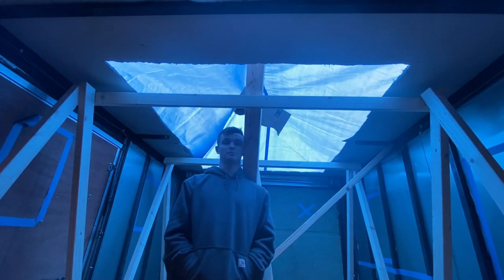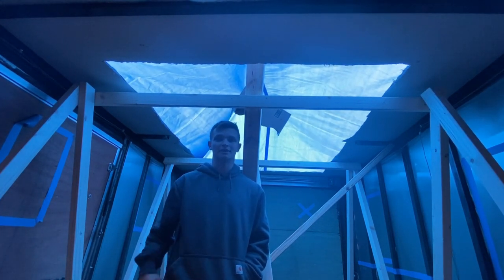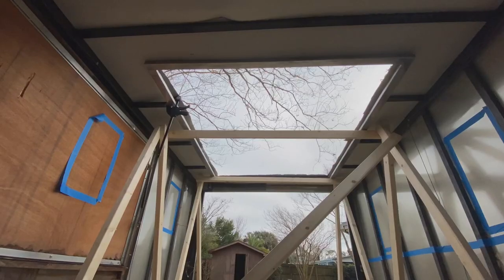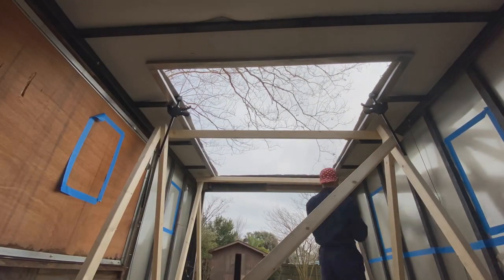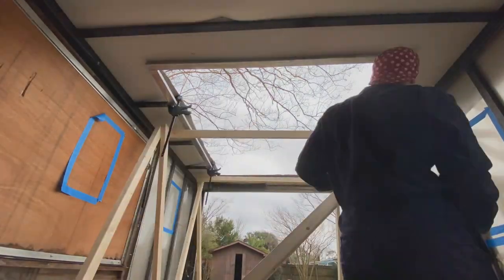So yesterday, it barely even sprinkled, if anything, but the wind did pick up. And I'm MIG welding, so the gas coming out of the nozzle would have been affected by that, and I just would have had poor welds. So I had to hold off till this morning. Wind is still kind of up there, but it's gusting. I'm getting periods where the wind's dying down, so I'm just going to weld it in between those gusts and probably get everything done today.